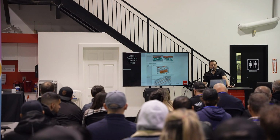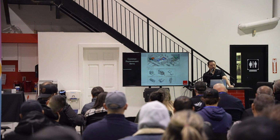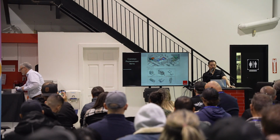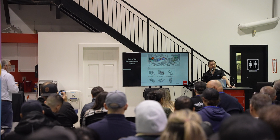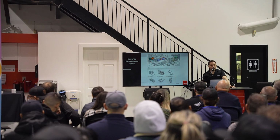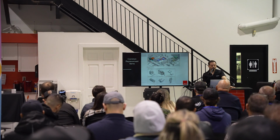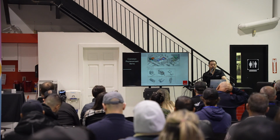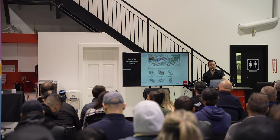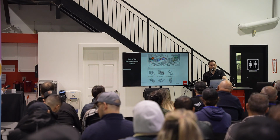So I'll continue on. We've also got a list of commonly replaced items. Sometimes we look at the machine and we think every part is just small replacement items, but there are some extra ones. There's the pumps. The pumps are always moving. They're lubricated. They do wear out. So the pumps are a replaceable part. Then you've got your cap tops, which we just talked about. We've got your wiper and dampers as well. Dampers have a valve. Ink's always flowing through it. They do wear down as well. So the dampers typically last about 1 to 2 years, depending on usage.